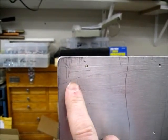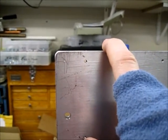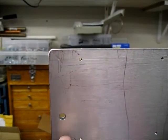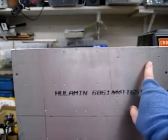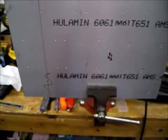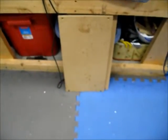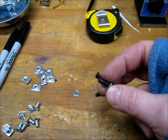Here's my plate. I've marked and center punched holes 10 millimeters from the front and back edge. The first hole is 10 millimeters from the edge to give the most support around that hole, and then I split the distance between those two 10 millimeter holes into thirds and put two more holes equally spaced on both edges. Here is the collection of hardware that came off the original base plates — little button screws, button heads, and washers.